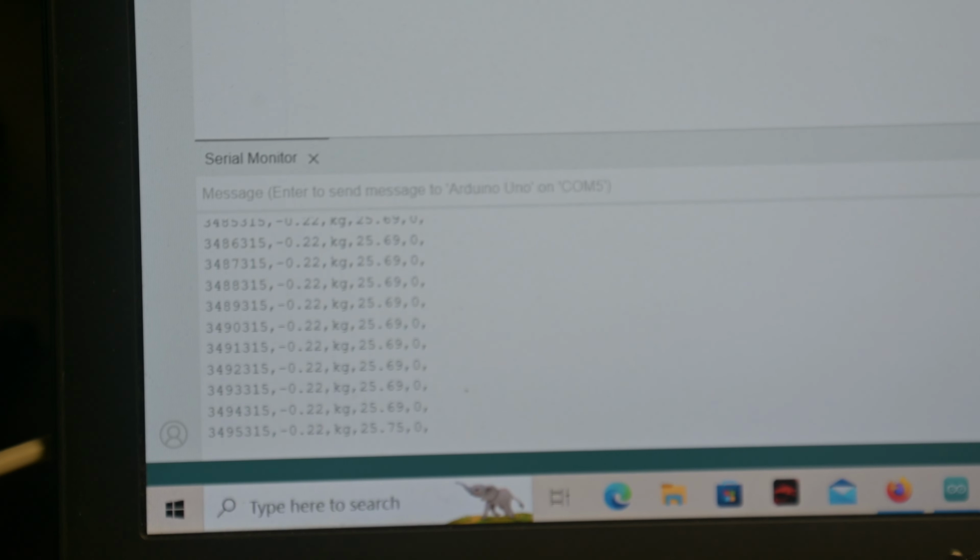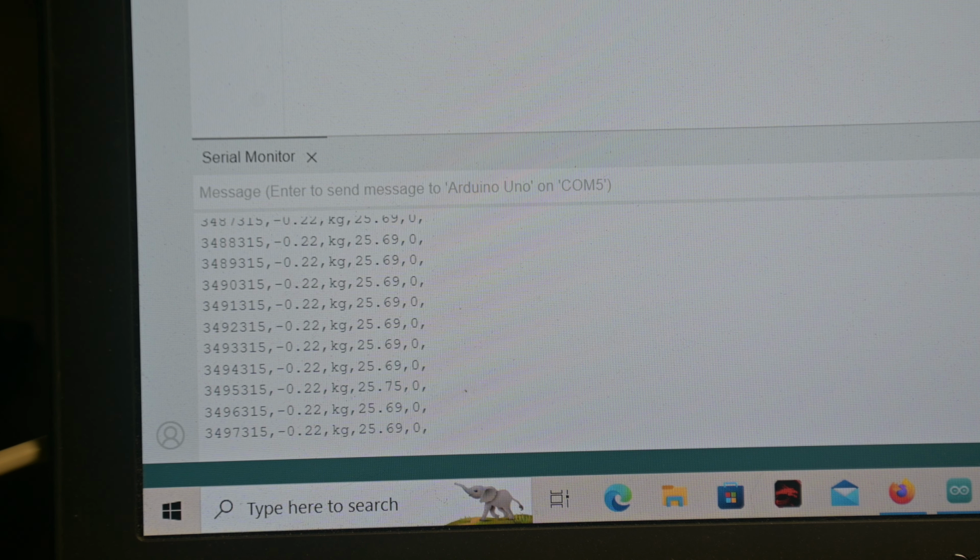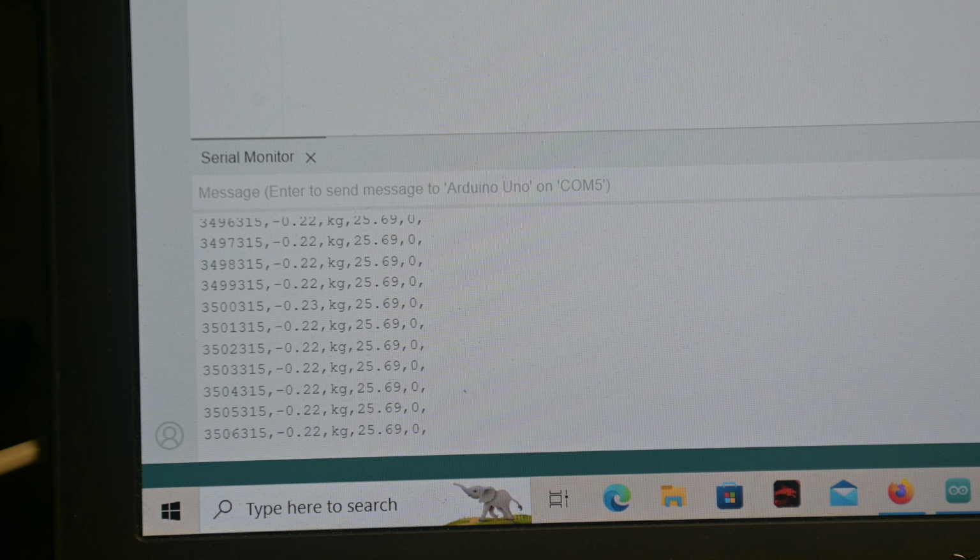And one thing I like about these AGFRCs is they are full rotational, which for RC doesn't mean much, but as a hobby servo for other uses, that's actually, to me, the benefit. Everything else I've dealt with so far is all 180 degrees. So anyhow, we'll give this one a quick test and see what kind of pull we get out of it.